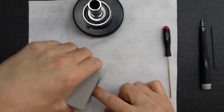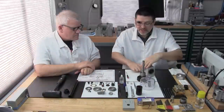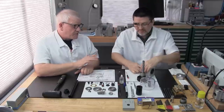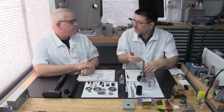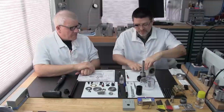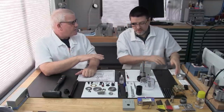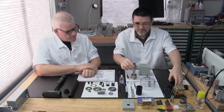And really important, again, this isn't so much about the insertion of the bearings. It's more that, like we've mentioned, anytime you have two parts together, metal-to-metal contact, it could be any materials, a common problem we see is corrosion and rust. Threads in holes, threads on studs, metal pins. That's right. Bearings. You got it. Especially when you're dealing with a product that, like this headstock, operates around coolants and cutting fluids and what have you. That's right.